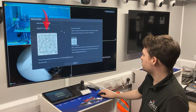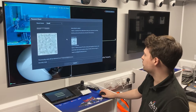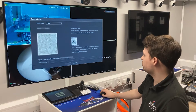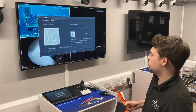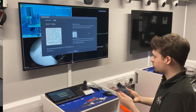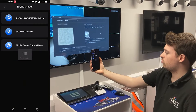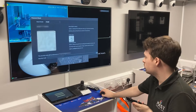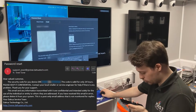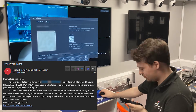You'll then see two QR codes — one large and one small. You'll need to scan the QR code on the left hand side using the DMSS app, and this will then send a security code to your email address. Using the DMSS app, I scan the QR code and it prompts me to say that a request has been sent. You will see the email containing that code, and once you put the code in for the NVR, you can then reset the password to whatever you want it to be.